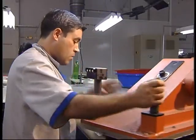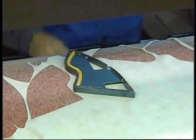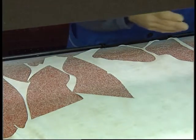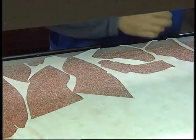Just as in manual cutting, the raw material consumption also depends exclusively on the experience of the cutter, as it is he who chooses the placement of the cutting dies and makes the best use of the skin. This cutting method with a cutting press is the most used in the shoe industry, although in many companies automatic cutting machines are beginning to exist simultaneously.